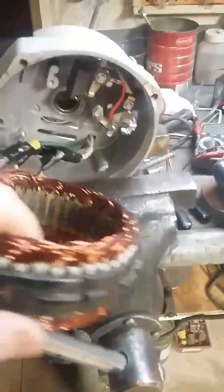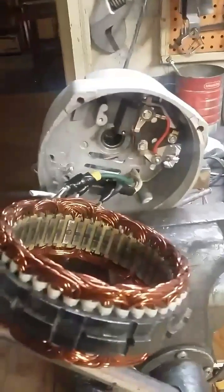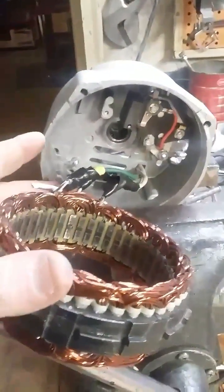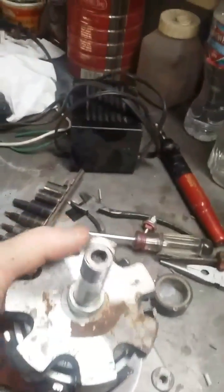I'm going to attempt to explain this efficiently. I came up with this idea to take any alternator and convert it into something usable for wind power without great expense. A lot of guys on the internet are taking the rotors out and replacing them with a neodymium magnet rotor — a permanent magnet — and those seem to work pretty good.